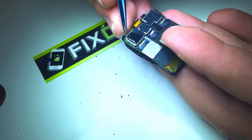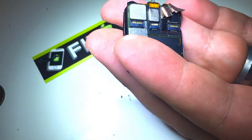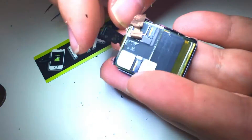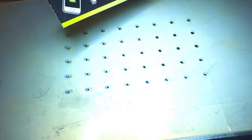We're going to take a little bit of alcohol and use it to help us pry up this sticker. This is a heat sink sticker. We're also going to pry up the digitizer connector because that is going to eventually be replaced anyway. Let's clean up our workspace and pull out our heat plate.